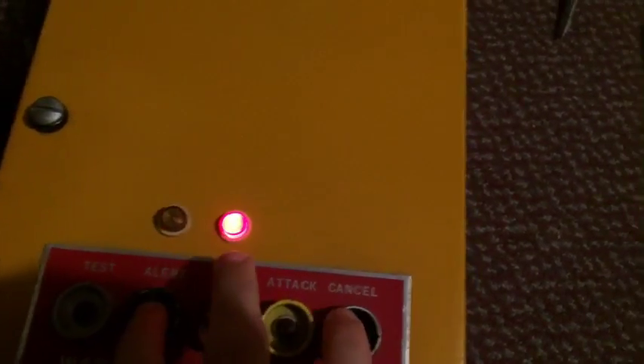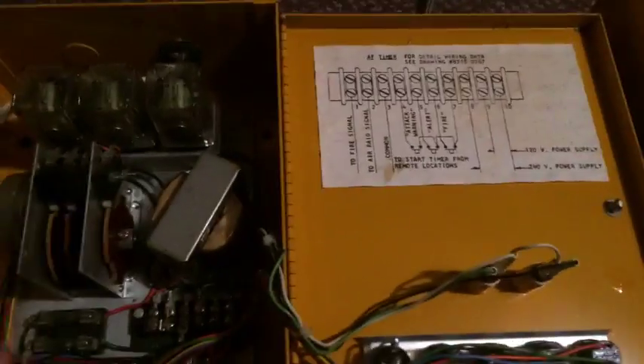Timers are now on. When you do the test on these timers, you will not hear a relay engage inside there. You can hear the relays in this one — alert, cancel. None of the relays will engage because it's automatically just taking power and sending it directly there. It's not using any relays to engage any of the cycle timers, which are those cams in there. In order for the test button to work, you have to make a jumper between terminals 1 and 2.